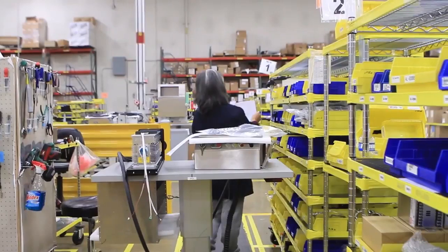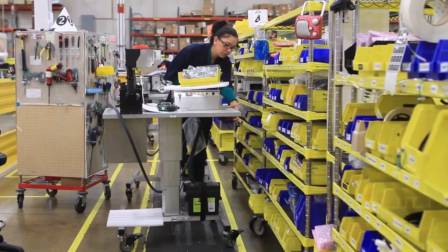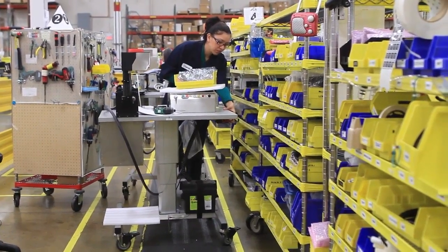So we're excited about the solutions that we're bringing to Videojet. You can see what they were doing out there before, and we've really made a lot of improvements as far as throughput. The feedback we're getting is that the Thomson lifting columns are very easy to install. There's a simple 4-bolt pattern used to mount the actuators on either side. The internal limit switches make it very easy to operate and integrate into their machine. And they're very pleased with the extension to retraction ratio and the combination of noise and speed that they get.